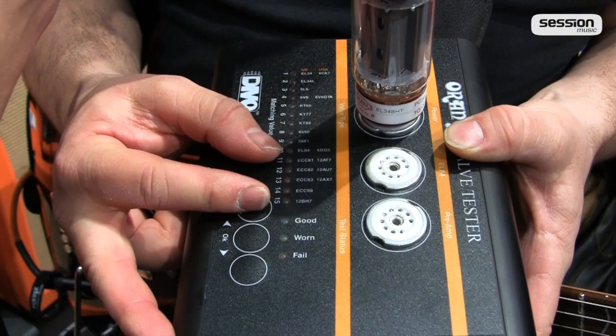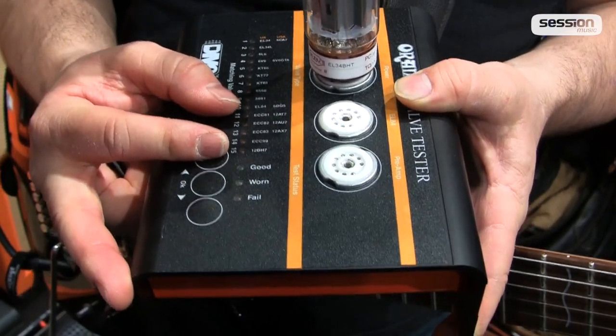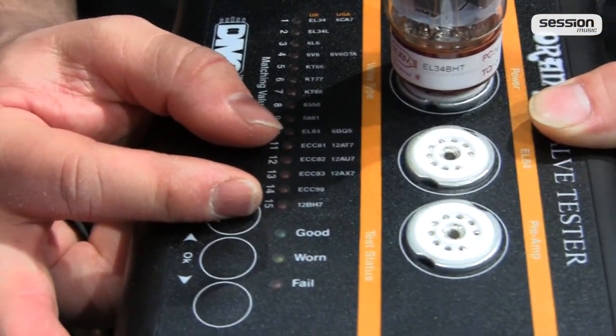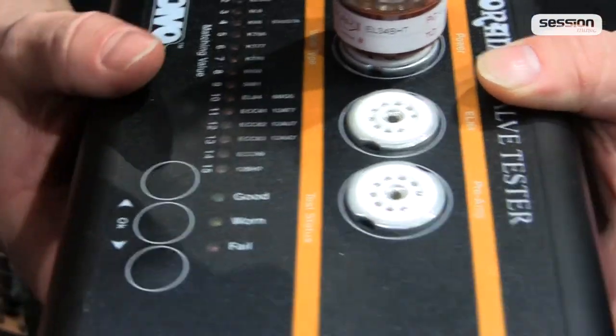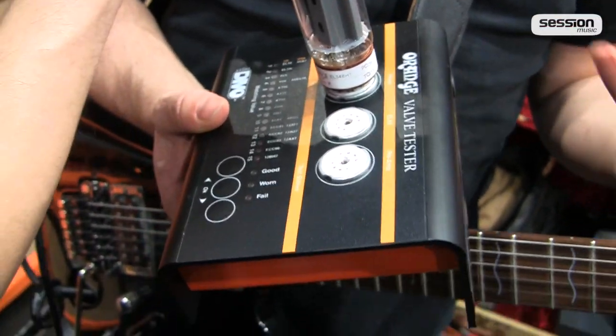At the upper end of the spectrum, this is what I was talking about with the OR100: when you're playing with a lot of distortion in your preamp section, you don't want a lot of distortion happening in the power amp section. You want it to give a little bit, and when you turn it up, you want it to not, because when you turn an amp up really loud, it gets really fast. Right. Because of the sound pressure level, it feels like the sound is right in your face. Yeah. And because of that, you begin to notice certain frequencies jump out a lot more than others.